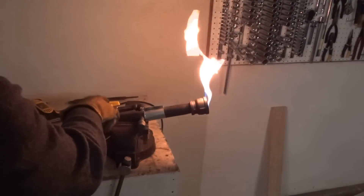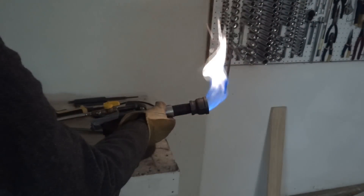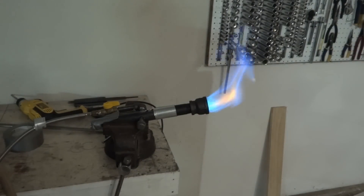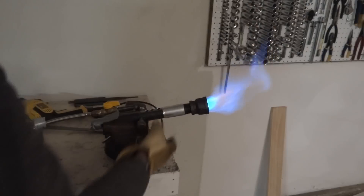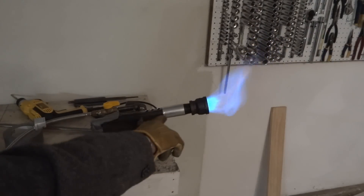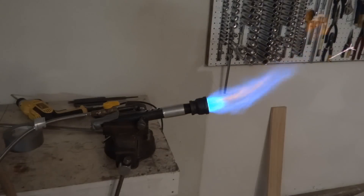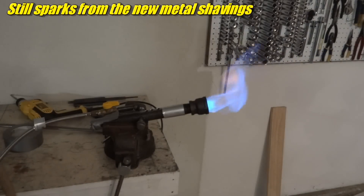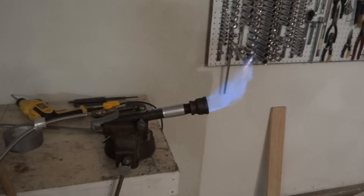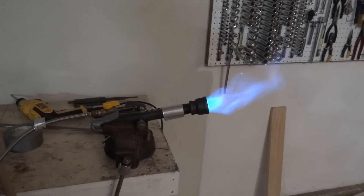If that suddenly goes out, turn off the gas instantly — don't let any gas build up. More air. I'm just going to crank the pressure a little bit. Maybe the pressure can keep blowing the flame out. Yeah, that looks pretty good — still a little rich. Check it out — all the holes are uncovered, we're getting a nice neutral-ish looking flame with cones in it. Oh yeah, look at that — that's what I'm talking about! This is exactly what's supposed to happen. Still might be a bit rich, but that is such an improvement — I'm calling it a win.